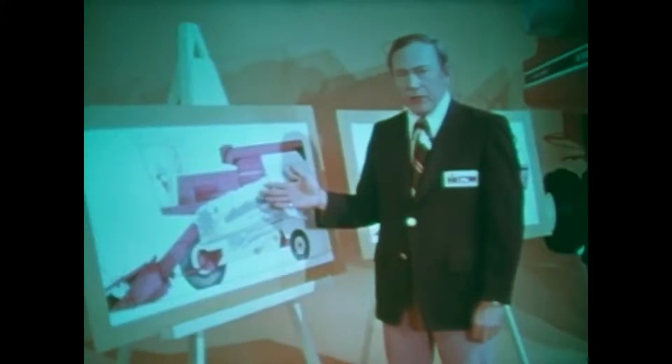Shown here at 1/25th its actual speed, the crop forms itself into a kind of cylinder as it spirals through the chamber. The material is spiraling much more slowly than the rotor, so it is contacted by the rasp bars several times, and it passes repeatedly over the concave on its way through — not just once, as in conventional machines.